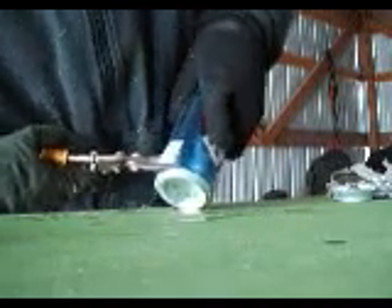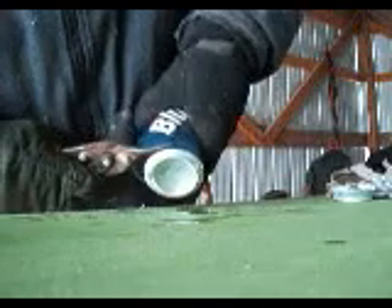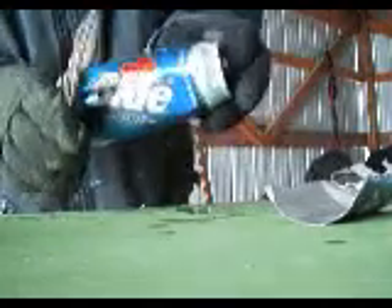We'll split the can in. Make one notch at the bottom, then make your horizontal notch at the bottom of the can. Put that in there, stick your tin snips in, put it in around to there, push that down. Take the bottom off, then the top — and voila. You can go pretty fast once you get going.